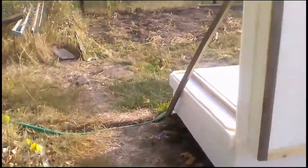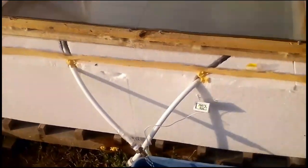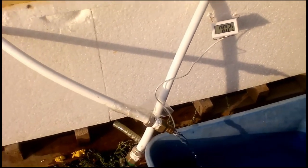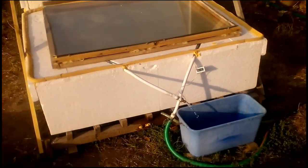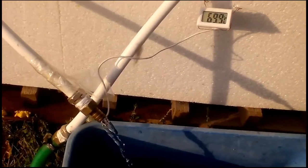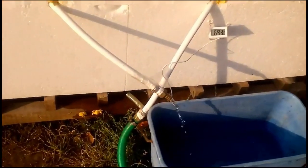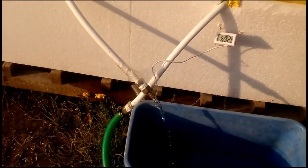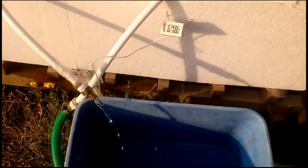After that, cold water began to move through this greenhouse from the cold water pipe. Now we see how the water leaves the pipe outlet, and this sensor shows the temperature of the water. This pipe has a length of 40 m and an inner diameter of 12 mm. We can calculate that the pipe contained 4 liters of water, which were allocated there for several hours, and therefore those 4 liters got the temperature of the water inside my solar heater. But now those 4 liters of water have already left the pipe outlet.